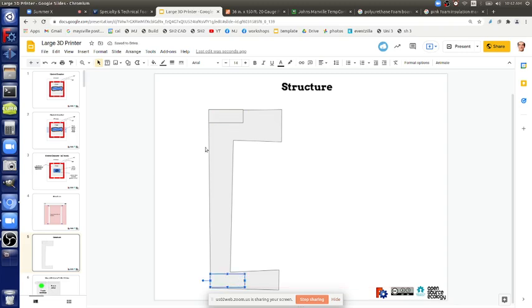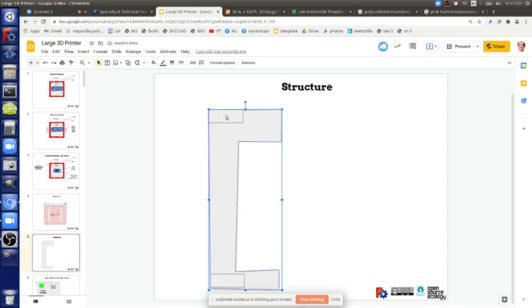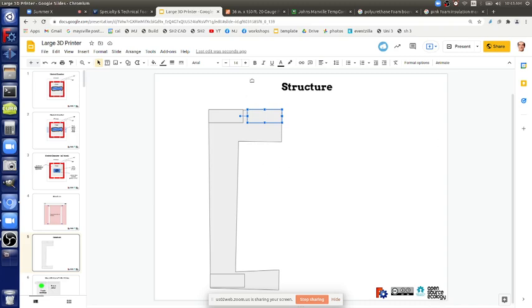Now, the parts on the top, they're in a heat zone, right? So you'd have to have an end structure, but you'd like it to be open so you have a wiper made of that same rock wool. Basically, what I'm imagining is there's a stud here, stud here, stud here, and top plates, and then you staple on your chicken wire, put in your rock wool so it's hanging out a bit, and then you've got your wiper. Then I'm not sure how you would attach the chicken wire the second time, but sandwich the rock wool between two layers of mesh wire. Does that make sense? No.